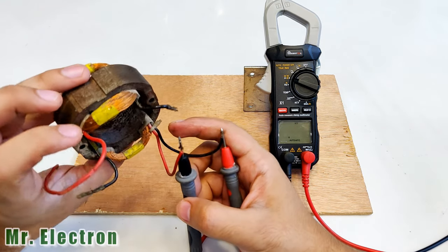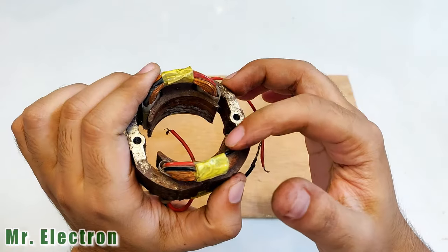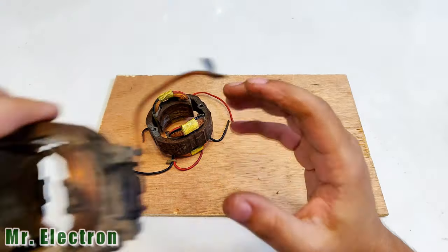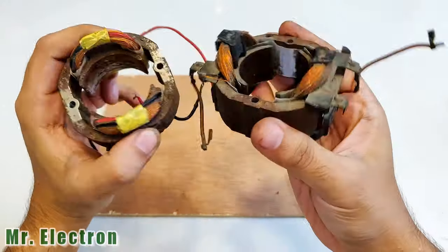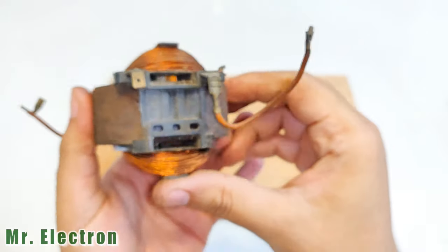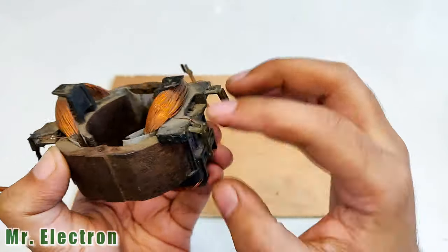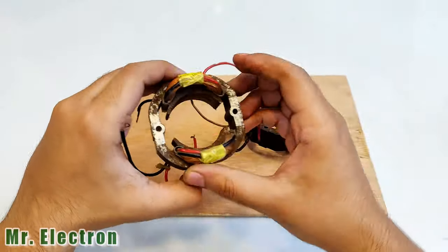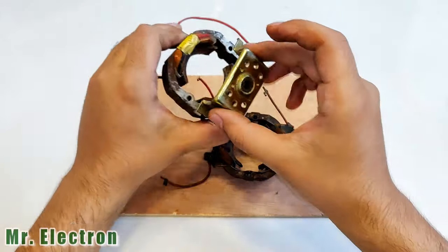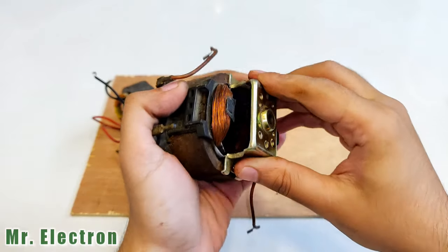The bad news is that I think there is some shorting in this winding, because the pole resistances don't match, so there is going to be imbalance. But guys, I was lucky enough to find an identical core — identical in diameter — but it is much more powerful with thicker copper windings. It also has these pin outs for easy connection, which was not the case with this cheap one. And this fits perfectly.